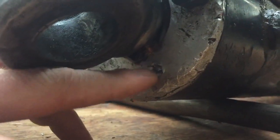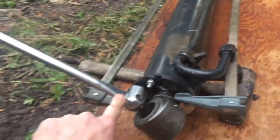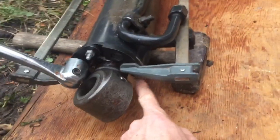The internal seals were bad. I've got the gland wrench clamped onto the cylinder so it can't pop off and strip the holes that are drilled in here. I drilled an additional hole right here because I torqued with two breaker bars — one in here, one in here — as hard as I could, and this gland nut did not budge.